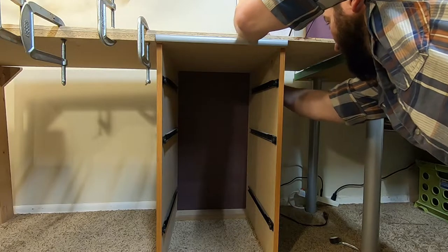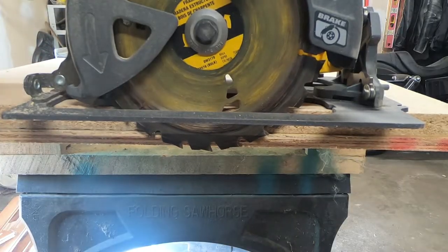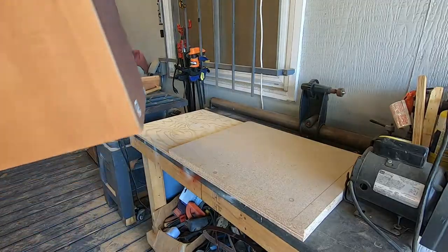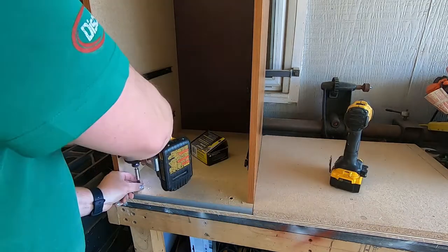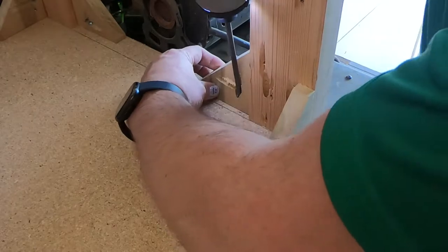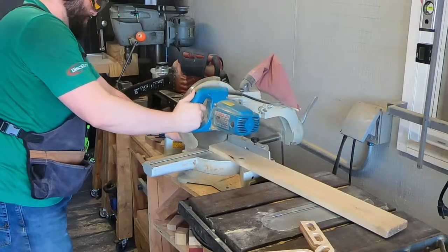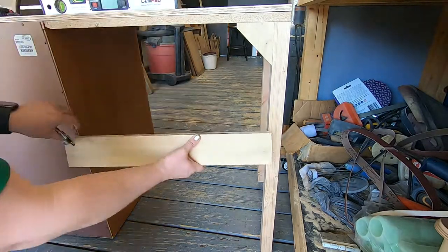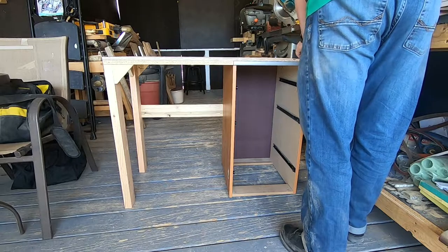I loosely placed the top on the cabinet and marked where I could trim the end off. Quick public service announcement to anybody with a yellow brand saw: when your light starts blinking like this, it means your battery is dying. I made sure to countersink the holes so that the screws wouldn't interfere with the drawers. I reattached the legs with the pocket holes and then gracefully maneuvered the desk back upright. This is the same poplar from earlier — I'll just measure it in place to make the stretcher. I measured and made a mark where the center point of the stretcher would go just to make sure it was parallel with the top. To level the desk I measured from the desktop to the bottom of the cabinet and transferred that measurement onto the legs.